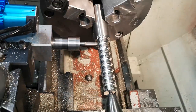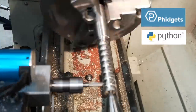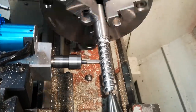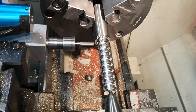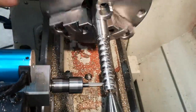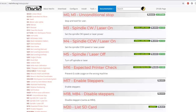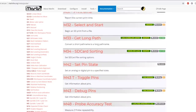I'm also having more people ask about how I coded it. Long story short, I use Phidgets with a PH, a Python script, and a laptop — I wouldn't recommend it. It's complicated, it's object-oriented programming, I still don't feel like I understand how it's working, and I'm a little embarrassed to show it to people. The right thing to do is to use a 3D printer board running Marlin, which is the freeware 3D printer firmware that's out there. Most 3D printers use a huge list of G-code commands to set temperatures, run axes, etc. So I think the very easiest thing would be to make a G-code translator and just use a plug-and-play 3D printer board.